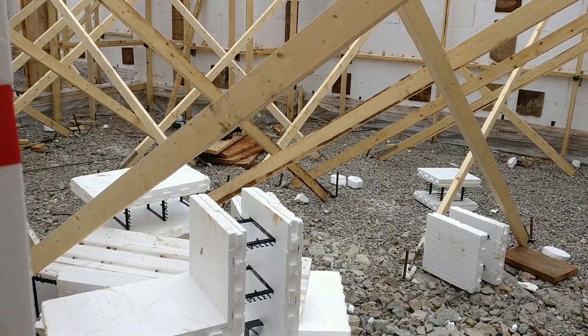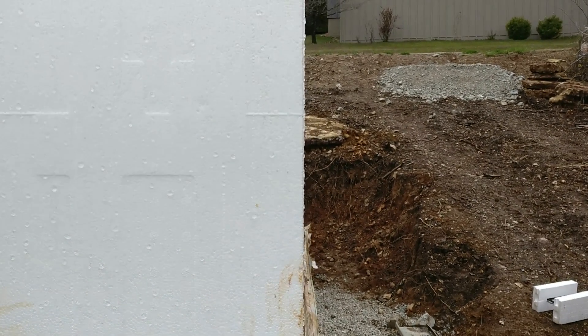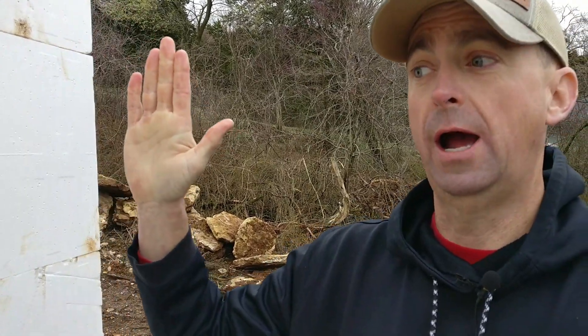Once we start pouring concrete into this wall, you look down it and see how perfectly straight it is. If the concrete gives any push or pressure as it's setting up, they'll keep watching and they can adjust those braces. They can push that wall or pull that wall — it's actually easier to push it out. So they might set it just maybe an inch inside so the wall leans in just a little bit, making it easier to manage when the concrete comes down and creates pressure.